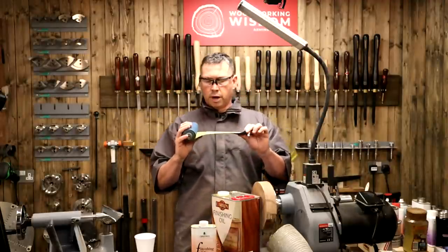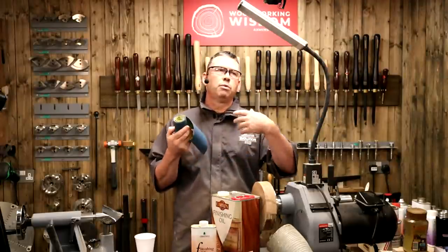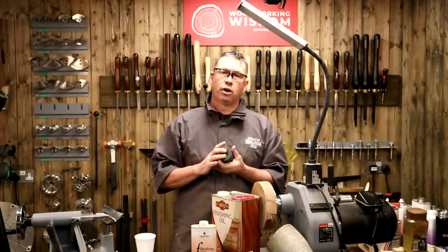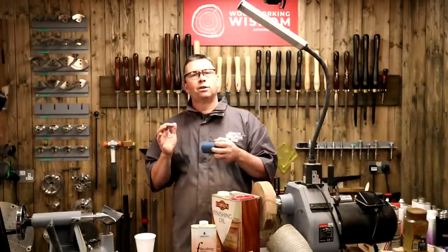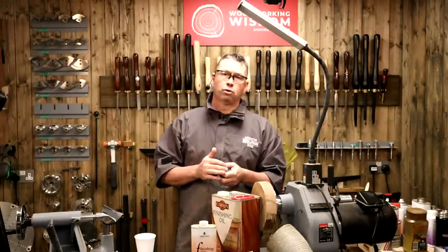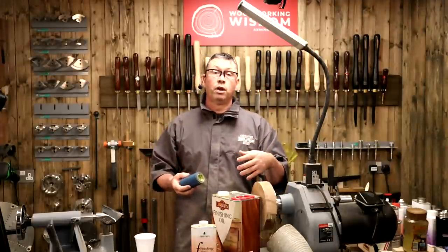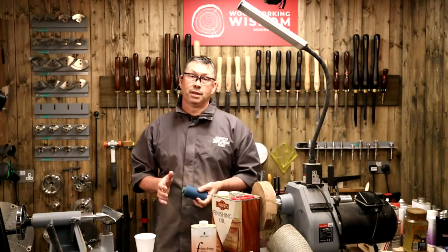So the RB paper, boasting the ultimate abrasive, this stuff, but I'd use this all the time. It's flexible. It can be used with water, with oil, all those sorts of things. Even my sanding discs are aluminium oxide. Just for me, it's the way to go, and avoid paper-backed abrasives on the lathe. They just don't last very long at all. The grip will. The actual abrasive part will be great, but that'll be on the floor because your paper is broken down and released the actual abrasive.